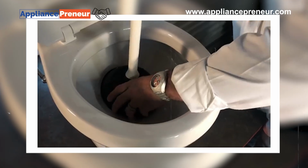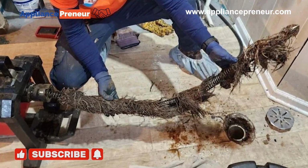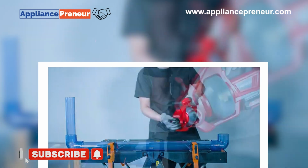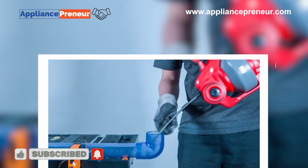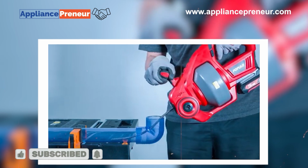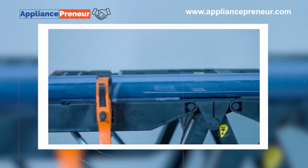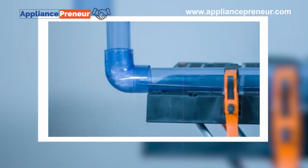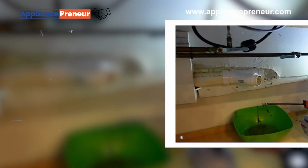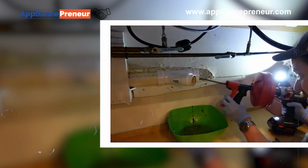If your plunger can't handle a clog, the plumber's snake or drain auger is your next go-to tool. This long, flexible tool is designed to reach deep into drains and clear stubborn clogs. Feed the snake down the drain and rotate it to latch onto or break up the clog. Once you feel resistance, you can either pull out the debris or continue turning to clear it. This tool is great for handling blockages in sinks, tubs, and toilets.